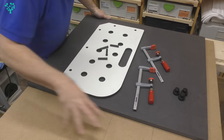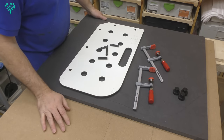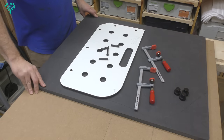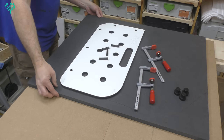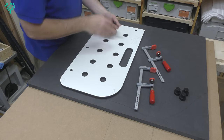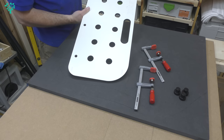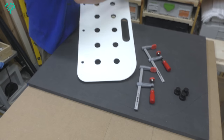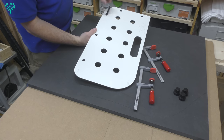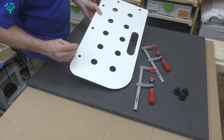I've got a couple of clamps and I've put MDF backer boards underneath for two reasons: I don't want to go into the bench I'm building, and I want to prevent any blowout on the back in case I ever want to flip and use the other side. Take your pins and put them in the alignment holes on the edge — with the Trend logo facing up. These are quite tight but they do go in. Everything on this is milled to a very high tolerance, though there can be errors — we'll talk about that in a second.